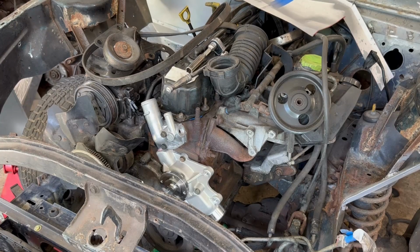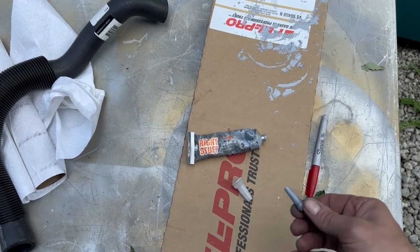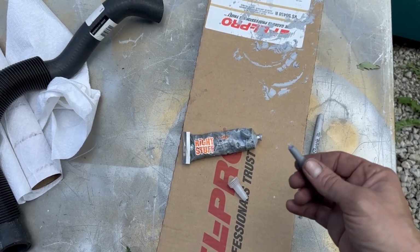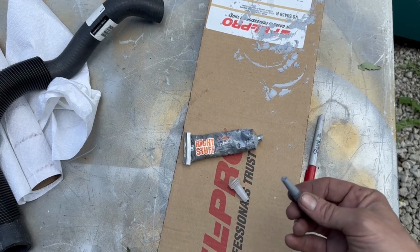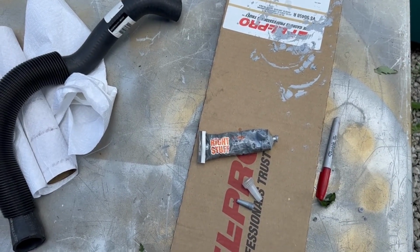Water pump, thermostat housing, thermostat, and the tube for the heater core are all in place. I'll put the temperature sensor in once I torque them down in about an hour, once the adhesive sets for all the silicone on the gaskets. This is a calamity of errors. I had a lot of little problems. Thankfully it all went smooth once everything was on, but ooh boy, I think I remember, it was only about 4 months since I did it last time, but the sealant I like to use for gaskets that go in the cooling system didn't work so well. I ended up having to cut the tube open because the stem hardened inside of itself. Thankfully that was still good. But it should seal up well. I'll bring it back when I torque everything, and then I can move on to welding again.